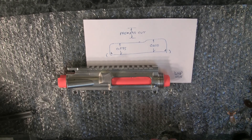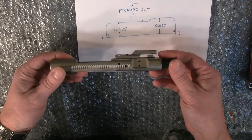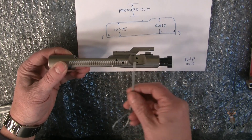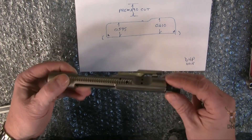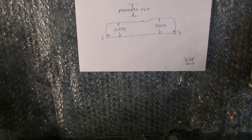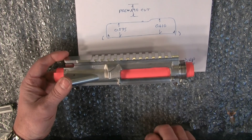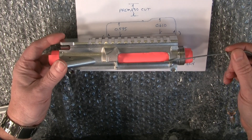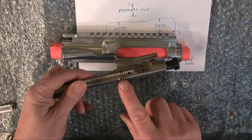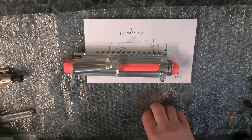One of the things I was concerned with: if you look at the bolt carrier, I have to make sure these are the rails it runs on — here, here, here, and here, and of course on the opposite side. When the bolt carrier is in here, I know I cannot take this edge so far down that I don't have the surface for the lower rail to run on. That was a concern, and I did a little bit at a time.